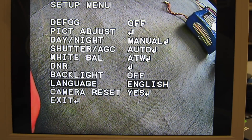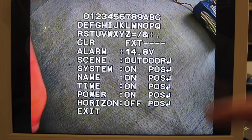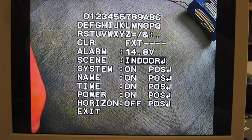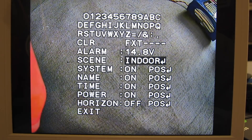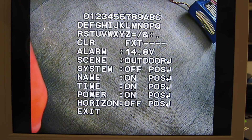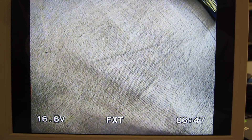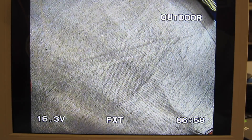Noise reduction, backlight, camera reset and exit — we'll save them. You can see that mine is the PAL version. If you push and hold the up button, you can change your call sign or pilot name. You can change the scene setting here as well — outdoor, indoor, light — so this is the sort of one-touch scene setting. If you push and hold the left button, you get the chance to calibrate the on screen voltage that is displayed — that's very cool. Push and hold the right button, you change the presets.